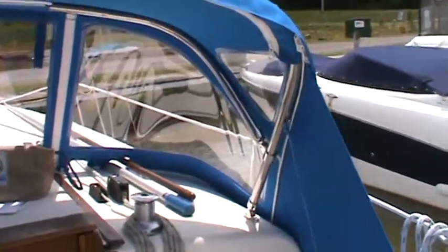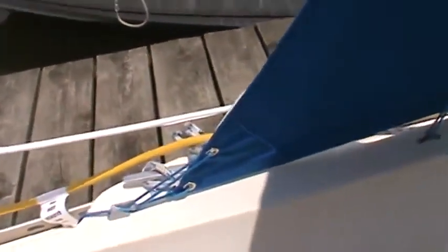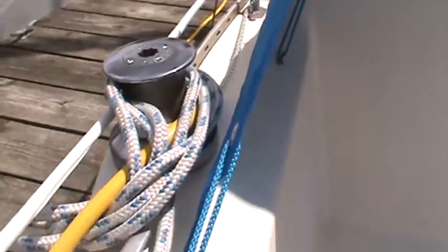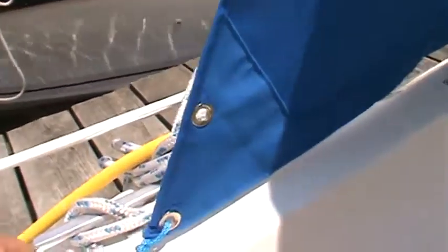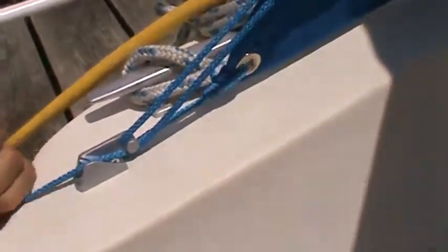When sailing, there's ample room between the top of the Dodger and the bottom of the boom, so there's no issues there. I'm going to swing over to this side so I'm not shooting the film into the sun. The Grampian has its Genoa winches on a flare-out in the combing, so to accommodate those, we have installed a quick-release cleat for the side wing so that it can be rapidly eased off and moved out of the way forward for complete access to the winch, and then brought back nice and quick to be tensioned — just like that.